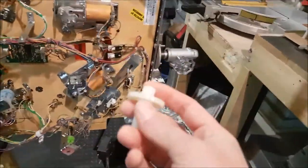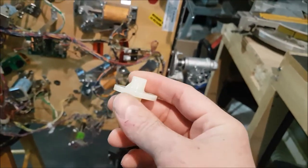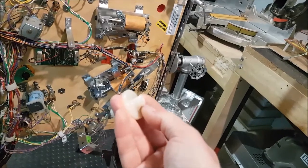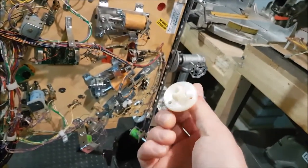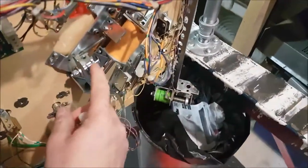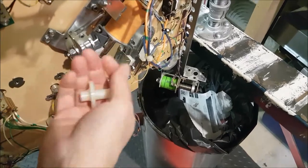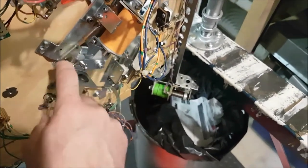You know the story about the little nylon shafts that were not included? I cleaned one and used it, but realized that this bushing was about one or two millimeters too tall — maybe it was from an older game using a slightly taller shaft. So this flipper, when installed, was extremely sticky and not moving freely because this assembly was too high compared to the hole in the bracket. The movement was just not at ease.